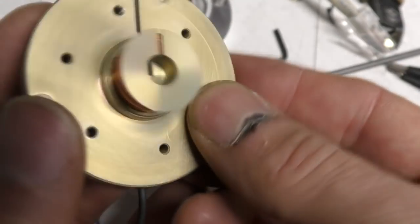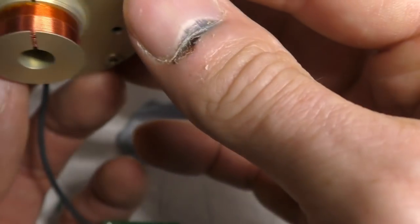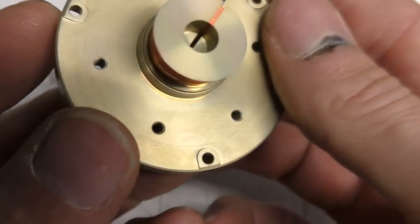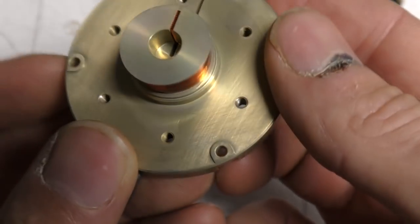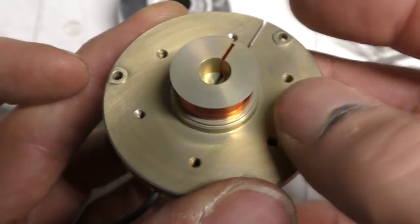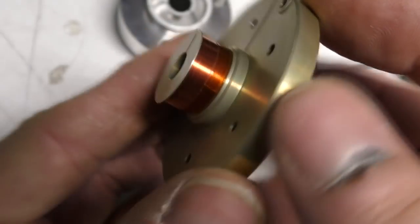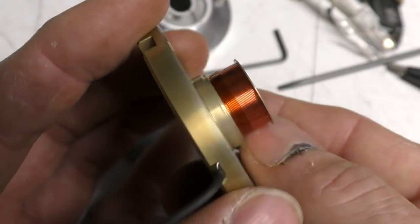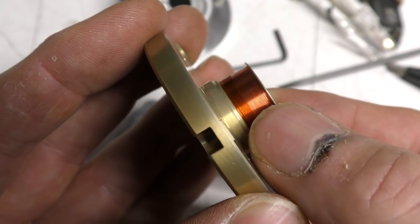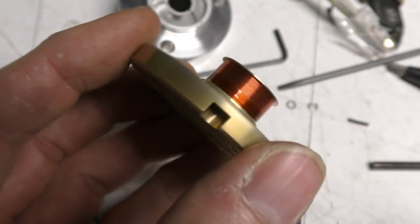Now I'm not quite sure how the sensing works. There are 4 wires that come out of here. I wonder if it's just something like a 4-terminal sense to measure the voltage across the coil. I can't see anything obvious, unless it's a coil that they put some AC through to sense the position of the magnet, but that would probably be affected by the excitation fields. I don't really know how that works, but the focusing is probably a closed loop through the wavefront sensor. Unless, I suppose, the other thing, it might be a temperature sensor perhaps.